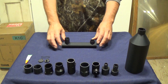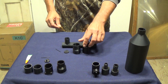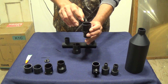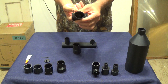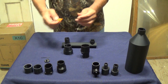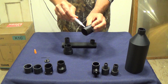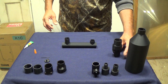We're going to grab the main tube body for the pump and put together one of our one-way valves. We're going to need that piece, this piece, one of our little flappers, and a pin. Let's turn the main valve body over, grab our flapper, and you want the smoothest side of that flapper down towards the actual seal plate inside the main valve body. We'll stick that down in there, then stick a pin right through both of those, and we now have a one-way valve ready to go. This is the output side valve, so we've got a top cover for that, and we're going to add a little super glue all the way around it. We'll stick the top cover to our one-way valve and set that to the side to let it dry.